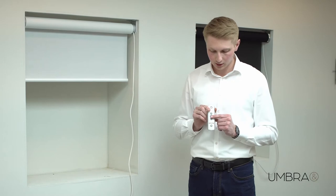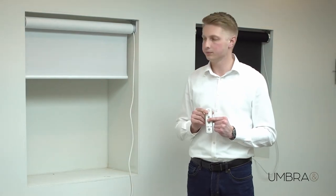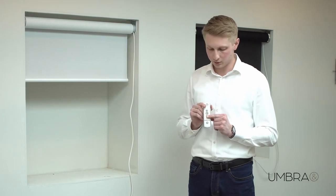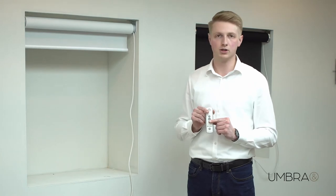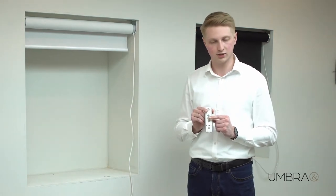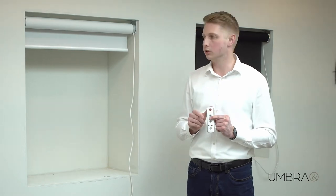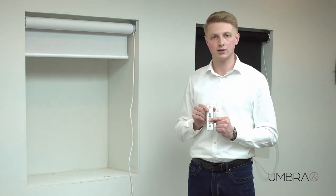To rectify this, you press and hold the MY button until the blind shunts. Now you'll see when I press and hold the down button, the blind travels up — the turning direction of the motor is being reversed. So let's change that back again so it's correct for this demonstration. I'm going to press and hold the MY button; it's going to shunt, and now when I press the down button, it travels down.